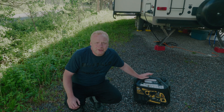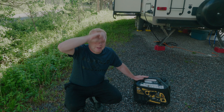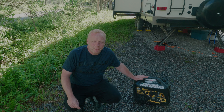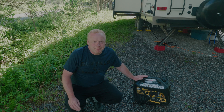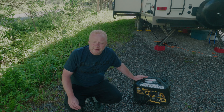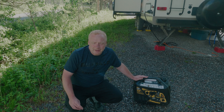If you're looking for a generator, look for an inverter generator — it gives you a quieter unit. This one has an economy switch that cuts the revs and only draws power when it needs it. A lot of people buy industrial-strength generators, but when camping you don't want that — it'll be too noisy for your neighbors. We can block it with trees or hide it behind the trailer, and it does about 50 decibels when running, which is pretty quiet.